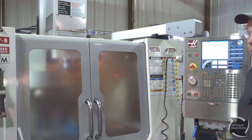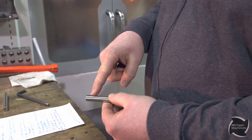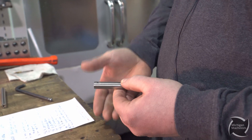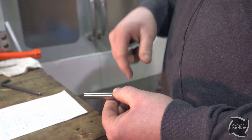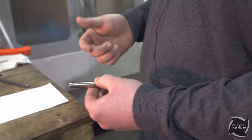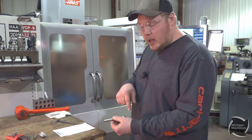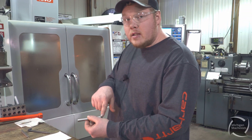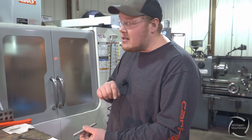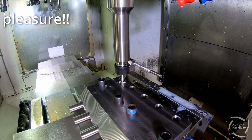So we're going to shut the door and hit go. It's going to spot those holes in the back first — spot all those holes in all five parts and then drill through. Our bottom fixture, just like our top, is clearance on the bottom side, so when we drill through the scrap is going to fall out of the fixture out of the part. So when we go to send the tap, that scrap's not plugging the tap up and we don't break the tap — never a fun day to break a tap. After that's tapped, then we're going to come to the front, we're going to volume mill — which is basically a rapid roughing operation — roughing down this front 45 angle in steps. And then we have an inserted cutter and we're going to come through and take a finish pass, just to clean that up.